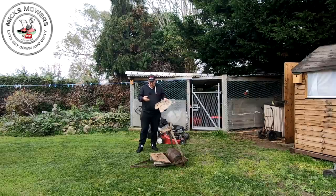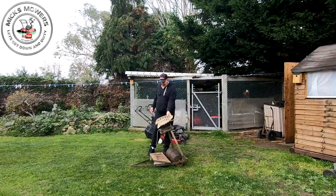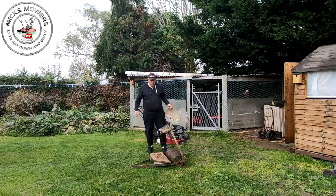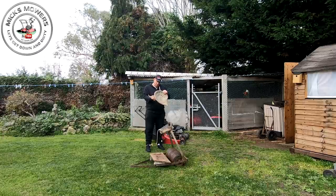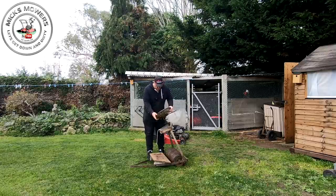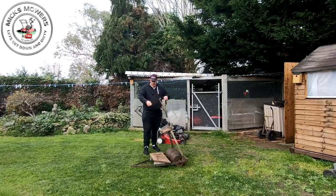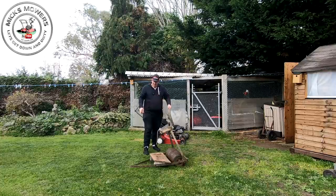which is not original to the seat, but I think that is much more appealing to the eye. And the other seats that I've seen have this style of seat on them. The bracketry is slightly incorrect for what I need, although I possibly could turn it around or do something with the bracketry. I might have to cut this piece off here and then just mount it on this one bolt just here onto the seat. And then what I could do is then possibly use this piece of metal, straighten that end up, heat it up and straighten it, to use it on the front end, which should give me about a foot for what I need.